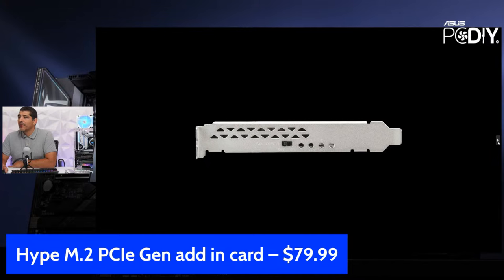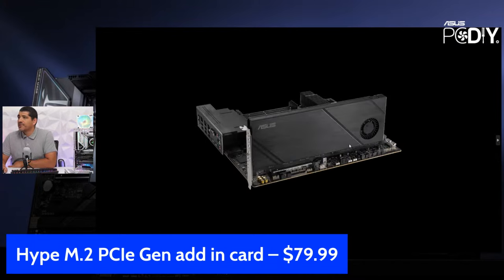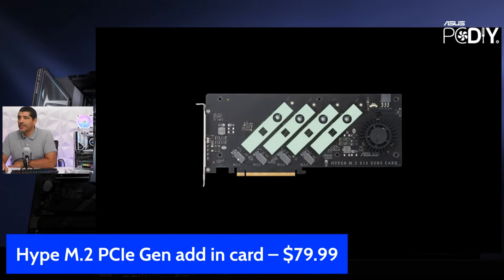So overall, pretty straightforward. You can also see that there is an option there to physically toggle the fan off and on. Pretty easy, pretty straightforward, single slot. Now, one thing that you do want to keep in mind is that this type of card is optimally suited for a motherboard that supports what's called PCIe bifurcation. The reason why it needs to support PCIe bifurcation is the slot essentially needs to be able to send PCIe slot signals to each one of these M.2 SSD slots, right?